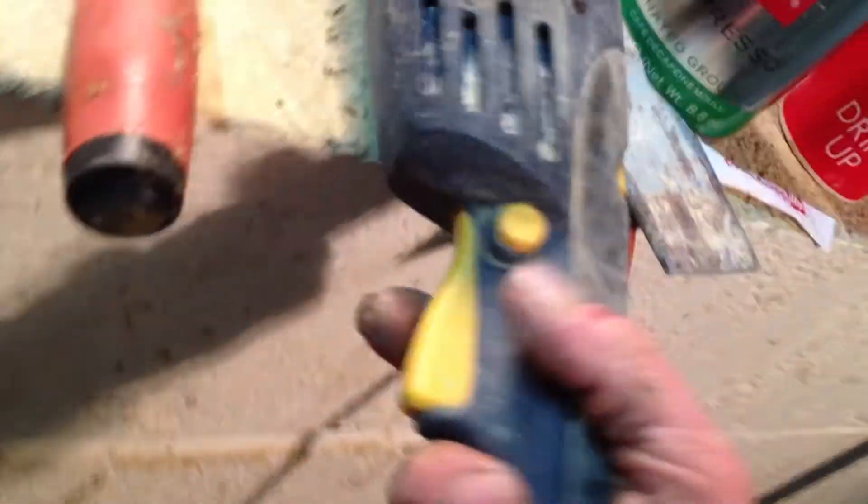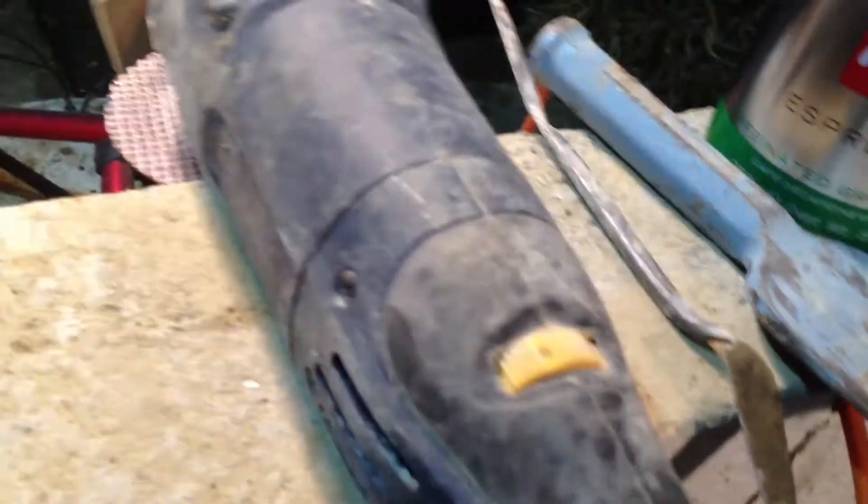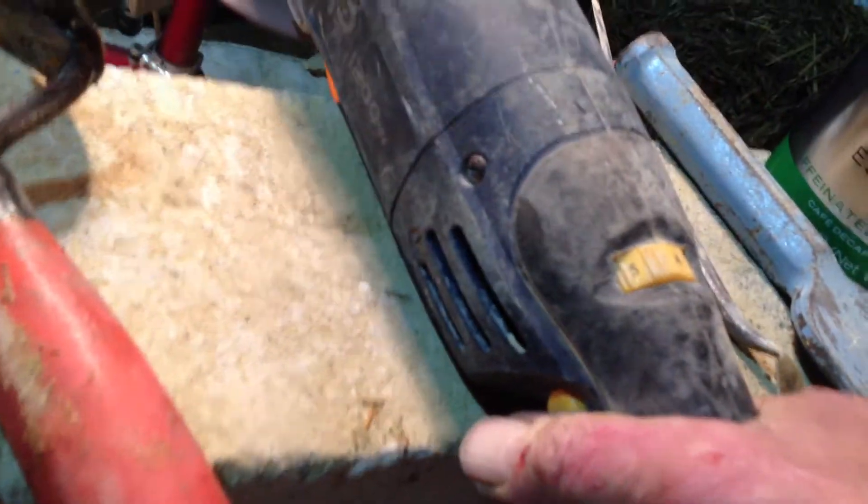Green glove. This is a really good tool for this job — I call it a mini grinder. It's a B&Q brand with an adjustable speed. That's the thing — adjustable speed — because if it just goes full speed you've got problems. It's got a slow start. I use it down around three and four.